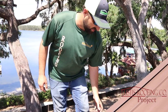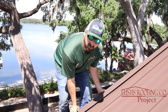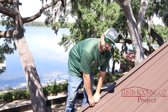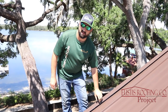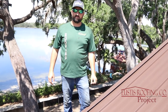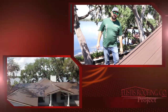This is our rake right here, and if you notice there are no fasteners — and it's strong, it's sturdy, it can withstand a hurricane. Your fasteners are hidden on the other side: this clips on and then it crimps to this piece here, giving a nice clean look with no exposed fasteners. That's the way this panel was meant to be put on. This is a standing seam roof — it's not supposed to have exposed fasteners — and we're showing you that today to protect you so you don't have that problem in the future.